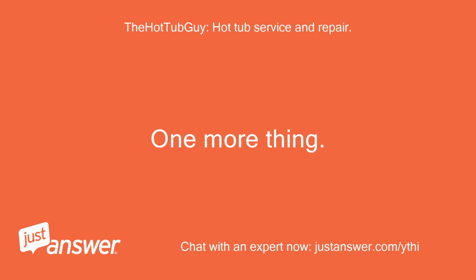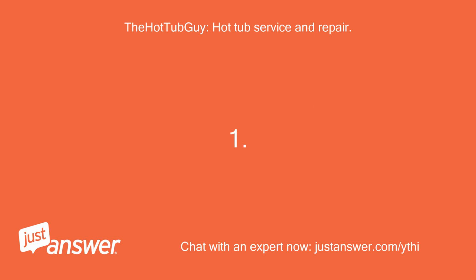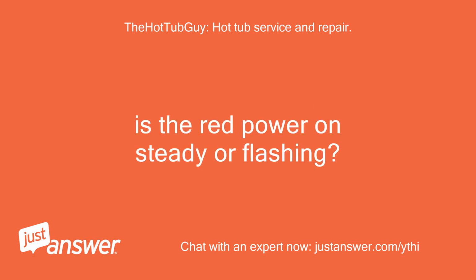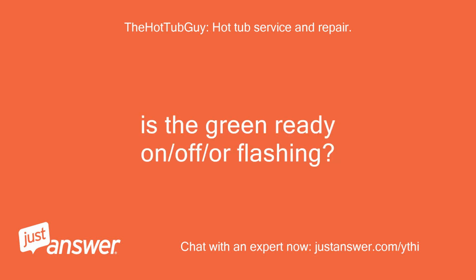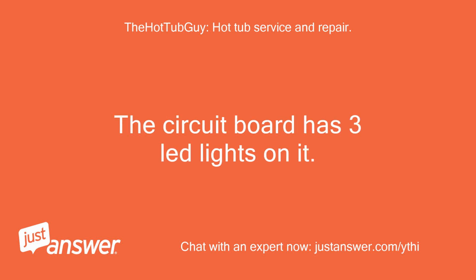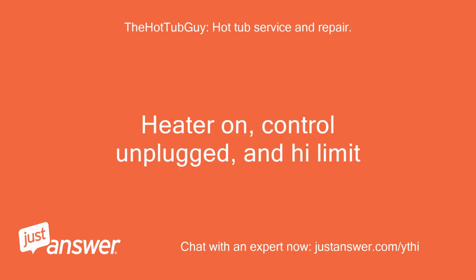One more thing. There is a red power light and a green ready light on the control panel. 1. Is the red power on steady or flashing? 2. Is the green ready on, off, or flashing? The circuit board has 3 LED lights on it. What is each one doing? Heater on, control unplugged, and high limit.